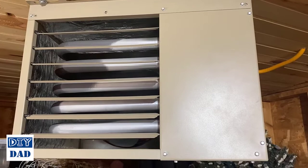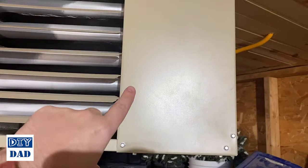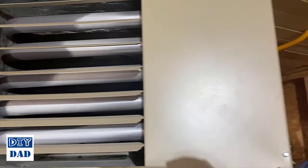This is my furnace — a typical forced air garage style heater. This one's a Big Max 80,000 BTU unit running on regular natural gas. It runs on a pretty simple premise: inside this piece of metal you've got a couple of burners that shoot flame into tubes, which heats them up, and then a fan on the back blows air across the tubes and pushes hot air out into the room.